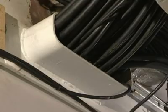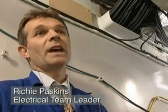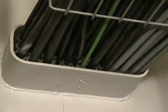The RISE system makes our job a lot easier. It's so much simpler than the system we had before — now we can pull all the cables in at one go, where before we couldn't. We save so much time; we can put all the cables in without needing a person on the gland, and we can come back at the end of the cable pull and fill the gland up completely.